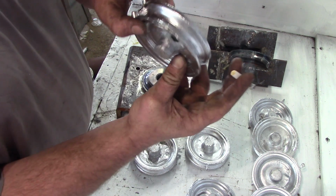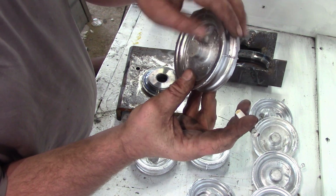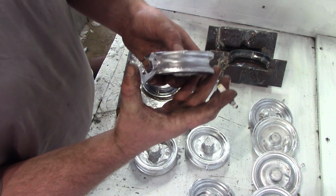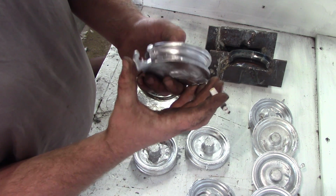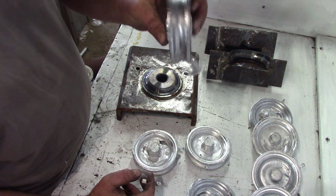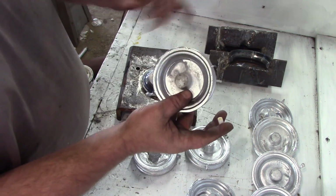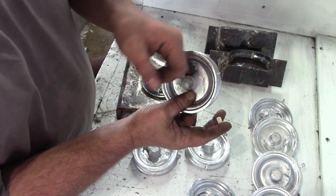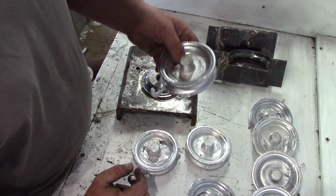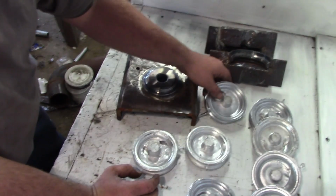However, I think if I made a much bigger riser next time, I can get them perfect. I'm absolutely amazed by the quality of the edge on this, you know, which is the important thing for me. These are just going to be rope pulleys, and it's going to be a hand operated block and tackle, so these pulleys are never going to experience more than what, I don't know, 70-80 pounds of force. So I'm gonna bore them out and put a little bit of metal putty in the voids, in the important places, and these are good enough for what I've created them for.